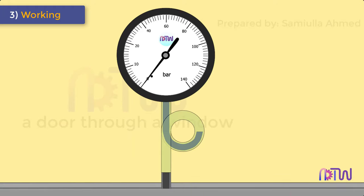In real-life applications, pressure gauges are mounted with a siphon tube. A siphon tube is a simple device used to protect a pressure sensor from high-temperature media such as steam. It can also be used to reduce the potentially damaging effects of rapid pressure changes. When first installed, the siphon should be filled with water or some other suitable separating medium. This medium continuously remains in contact with the Bourdon tube.